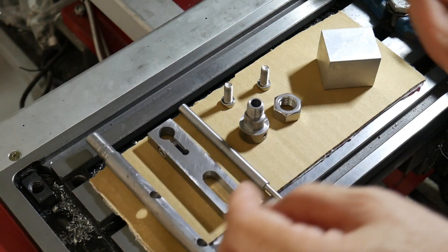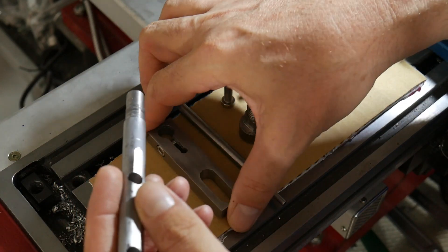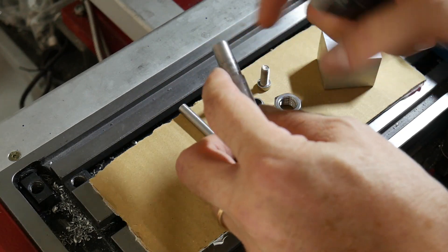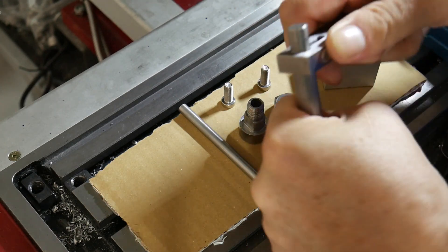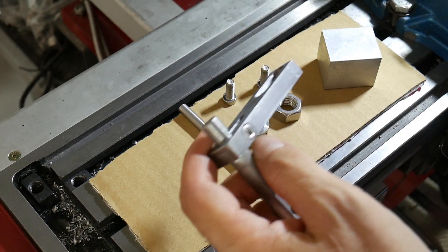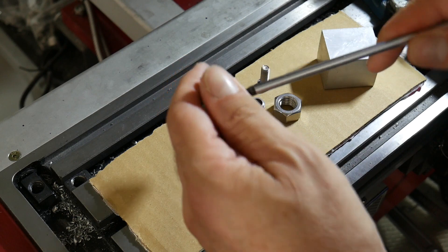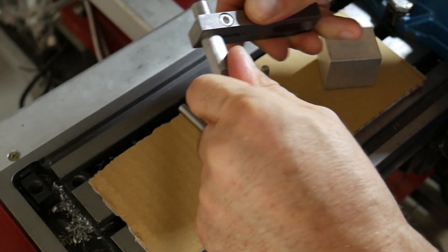It's arrived the moment to make the assembly. This is the part that I made in my video. This is the support that goes to the vise. The very important thing here is to make the diameter very tight and very close to the diameter that you make with the drill bit. Otherwise, it will not close. I close too much — it's okay like this, because I also want it to move.